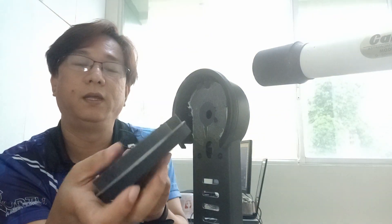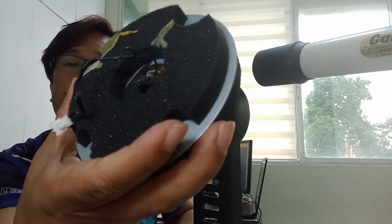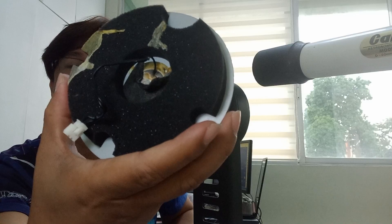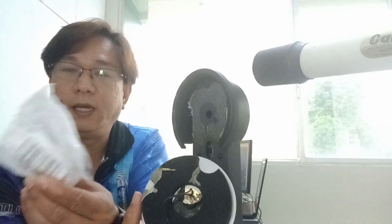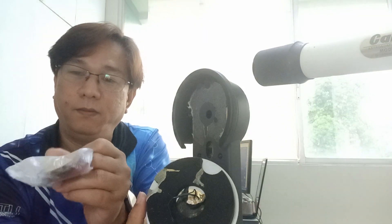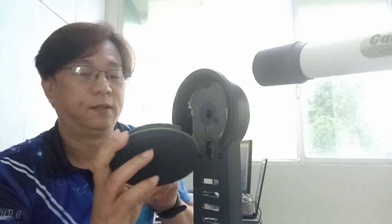When I tried to remove the covering, I found there might be no problem with the piezo sensor at all — one of the wires is actually detached. So all I have to do now is resolder it and then test it at home. If it doesn't work, I have these 10 pieces of piezo devices purchased online as backup.